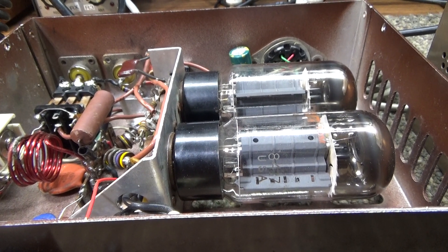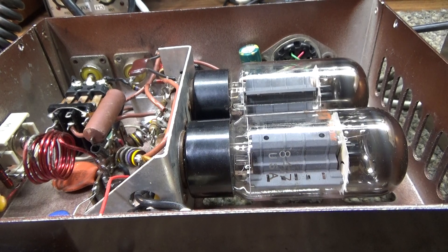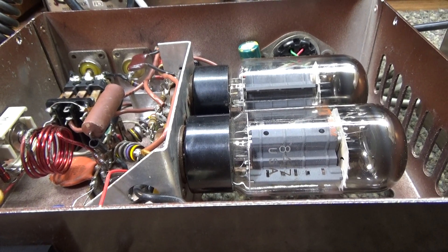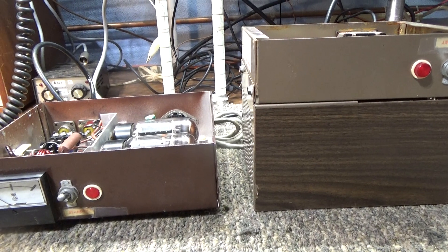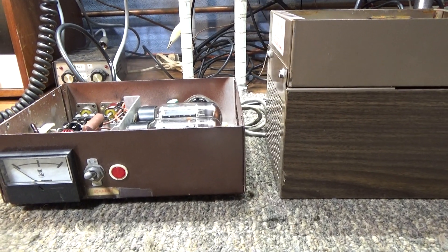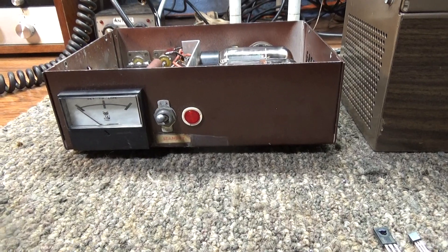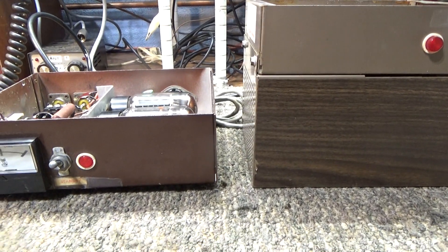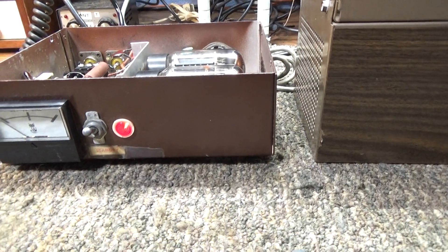The plus is you get a lot of swing, a lot more gain, and actually a more linear output than you do with grounded grid. What I mean by that: a regular radio putting in four watts, swinging to say 20 — if you dead-keyed 40 you'd want it to swing to 200 to match what the amplifier did, just make the signal bigger. But with most grounded-grid amplifiers if you put in 40 you're only going to swing maybe 100. With the Black Cat, you put in a dead key of 40 watts and it swings to 200 peak — that's what this amp is designed for.